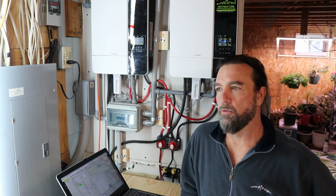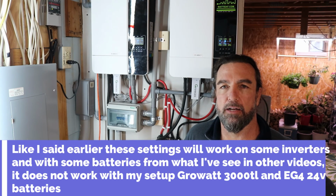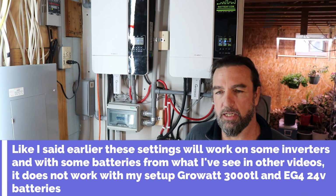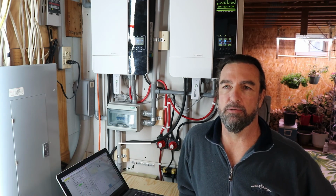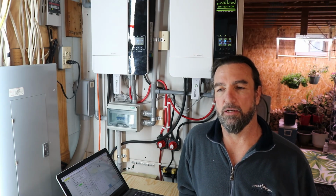So where do we go from here? Well, that's a good question. If anybody has any ideas or has seen something that I've done incorrectly, please let me know. That brings me back to the original testing that I did. I did thoroughly go through testing separate settings on dip switches, setting up sequence from 5 to 10 or from 15 to 20, making sure that none of the dip switches were repeated. I did set up separate patch cables that I actually made using the CAN ports to see if that would make a difference. That didn't make any difference.